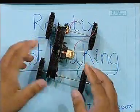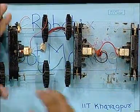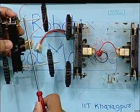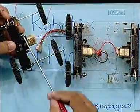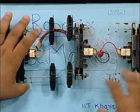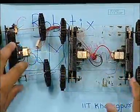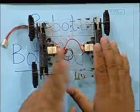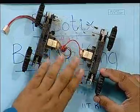Next is how to implement differential drive. This is our final bot. What we do is take two such gearboxes, cut the right wheels of the bot, and use only this half. We put two such pieces in a mirror image arrangement, and what you get after that is our differential drive. As you can see, both the left and the right are independently driven by two separate motors.